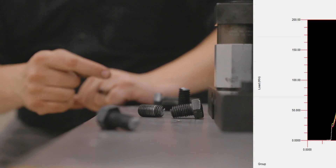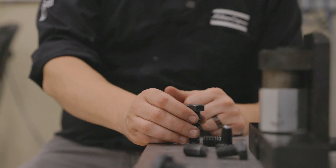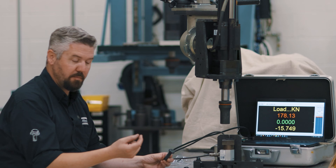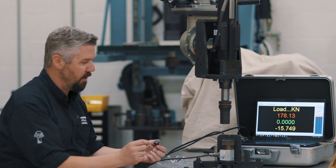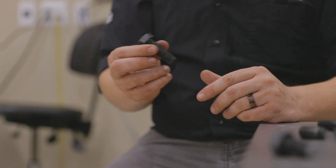So what does that mean? We see that the clamping force increases the higher the grade of the bolt, but what does that number actually tell us about the bolt itself? The first number — in a 10.9, the '10' — tells me about the ultimate tensile strength of the material in newtons per square millimeter. If I measure the cross-sectional area of this bolt in square millimeters, I know for every one of those square millimeters the ultimate tensile strength is a thousand newtons. A square millimeter is about the wire size of a large paper clip, so you can picture a bolt this big as a whole lot of paper clips — and as we can see, we have over a hundred kilonewtons of available strength.